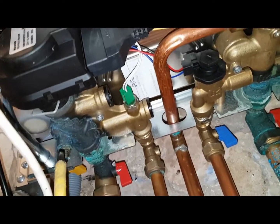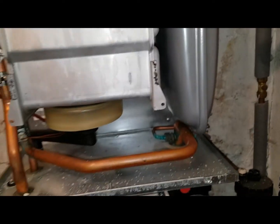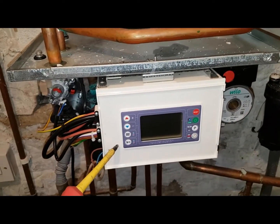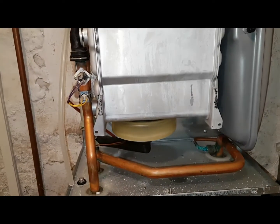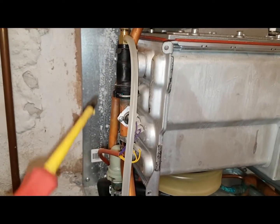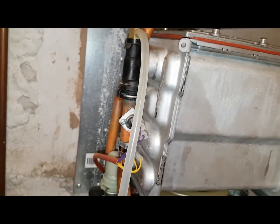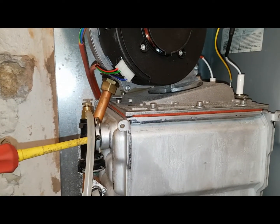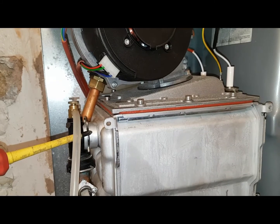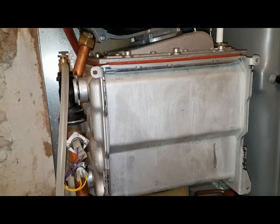So that's the main components of this boiler. Inside here you've got the PCB. Adam's question: what is that black plastic? It's just an elbow connector — the pipe goes upward and for it to go into the main heat exchanger it uses an elbow. It's got an O-ring connection here and one here, just to connect into it.